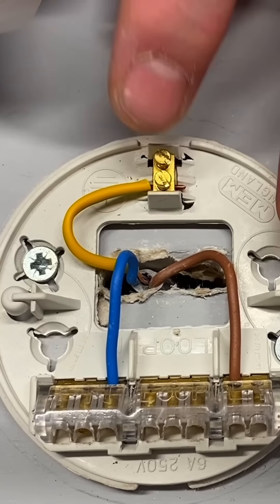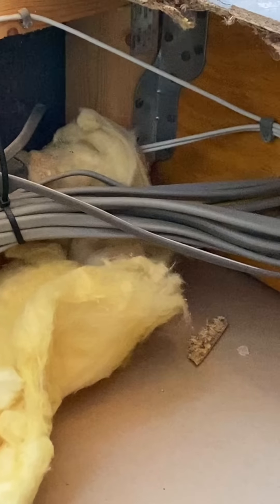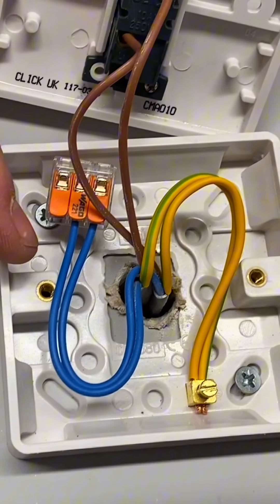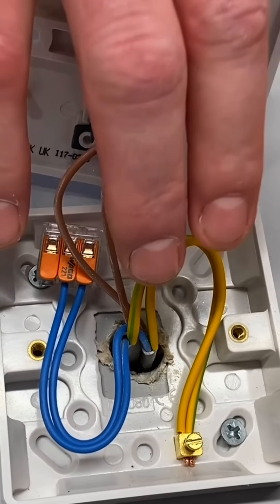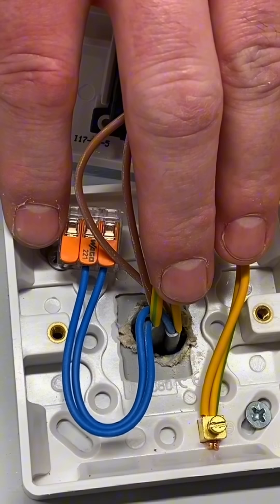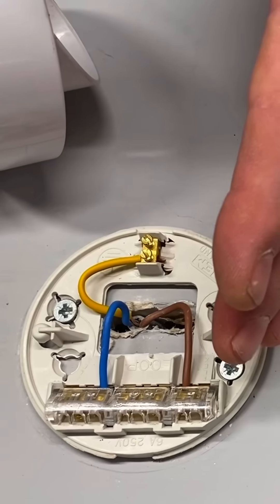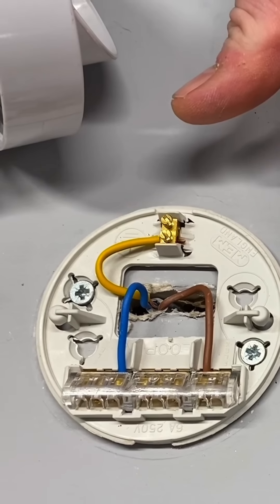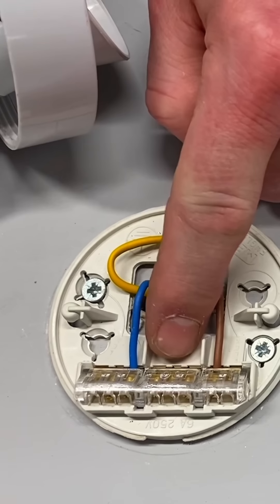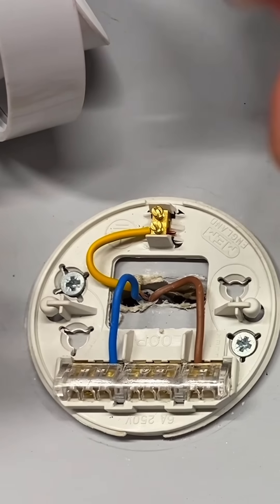So you've got a switching line but you haven't got that permanent line to go to the next area, whether it be the roof space or an extension. Surely there's a way of future-proofing the ceiling rose. We've already future-proofed the switch because we've got a neutral, so if this switch was changed to a smart switch in the future we have a neutral - brilliant. But when we come back to the ceiling rose and pendant, we can't actually take a supply to another room. We could take a feed to another light that comes on at the same time, but we certainly couldn't feed another room.